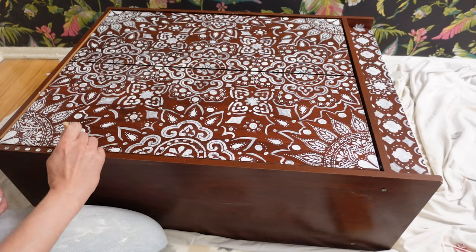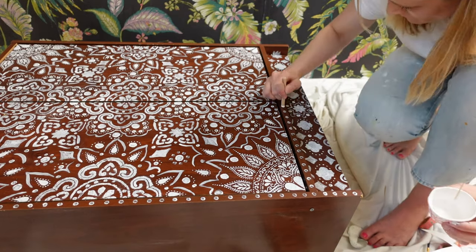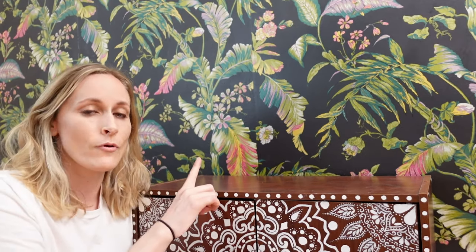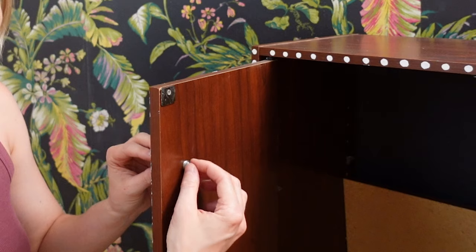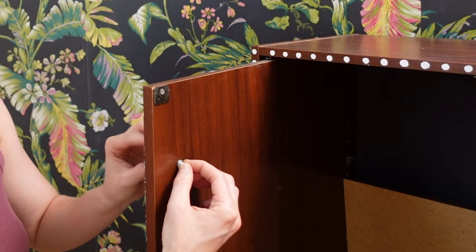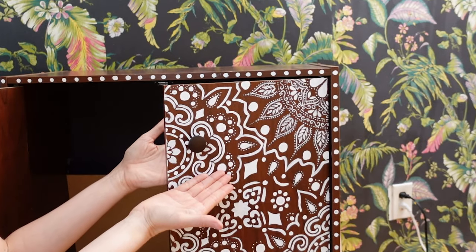Last but not least, we're hitting the entire edge with dots. I spent a long time doing a second coat on all of the design. The last step is to coat it with the Varathane Ultimate Polyurethane — this is a water-based sealer, it's clear so it's boring to watch, but it's an important step especially when using chalk paint and you don't want to finish it with wax. Now we're putting the hardware back on. Pro tip: the screws for this hardware were a little long so there was some looseness, so I just added a few little washers to fill that space and now it goes on tight.